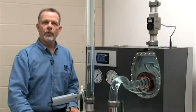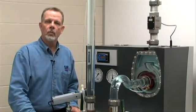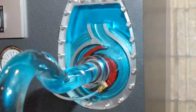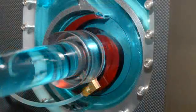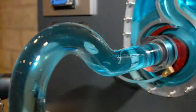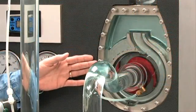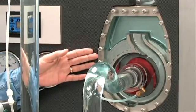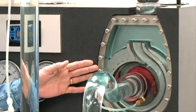Before we get started, let's review the piece of equipment we'll use for our priming demo — the glass-based pump. It consists of our very own 11.5A3 E1.5 single phase unit, driven by a variable frequency drive. It is the exact same 11.5A3 that we build on a regular basis here at Gorman-Rupp, with one small exception: we have taken this pump and sectioned the volute casing.